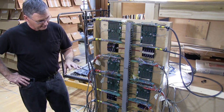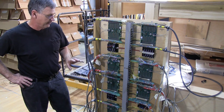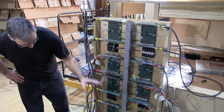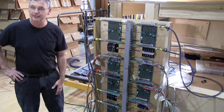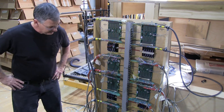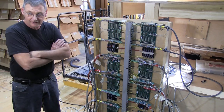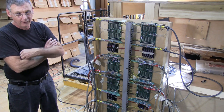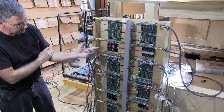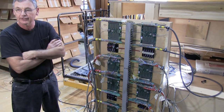And these driver cards are really good because you can just swap one out and know where you're at. Okay. And it looks like I see automotive fuses in here. That's correct. These are the same kind of fuses as cars. If you think about it, a car is 12 volts DC. All our rectifiers rectify the voltage down to 12 volt DC. So that's the type of fuse we're using right now.